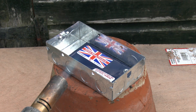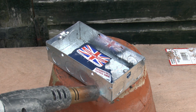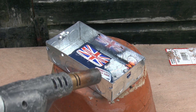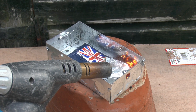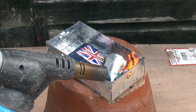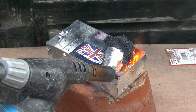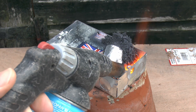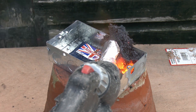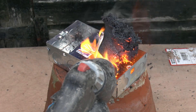Now, as usual, it's windy outside but we're going to just heat this up. I've got a gas flame here and I'm just going to apply the flame to one end. Now you see the plastic coating has pretty much melted away there — as to be expected. And you can see that inside it's basically a foil material, and the expanding intumescent material is contained between them. So as it heats up you'll see it's starting to expand — it's coming out pretty rapidly. It's a sort of black, fibrous material inside. And already it's expanded to fill the height of this particular box, which is 35mm. You can see it's going well beyond, and also note that where the flame is directly on this, it's glowing sort of orangey red, but the material itself isn't actually burning and disintegrating — it's simply dissipating the heat away and remaining intact.